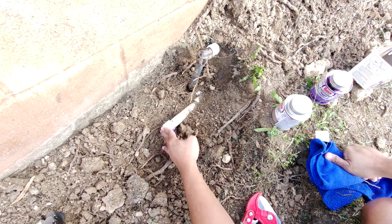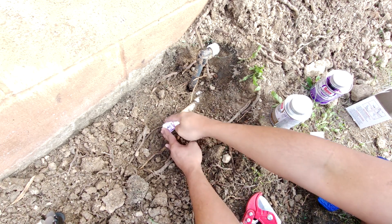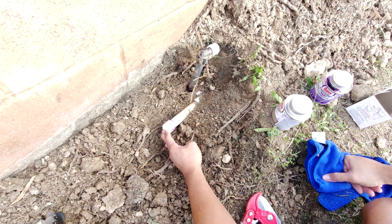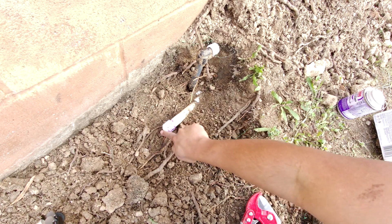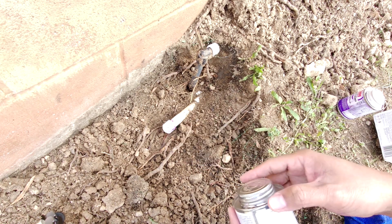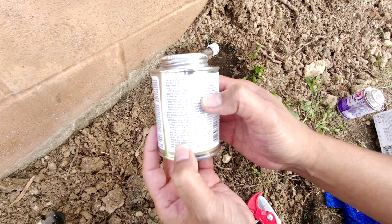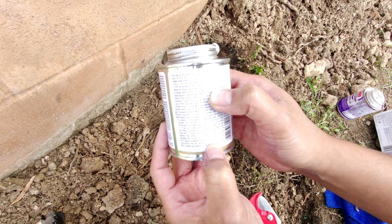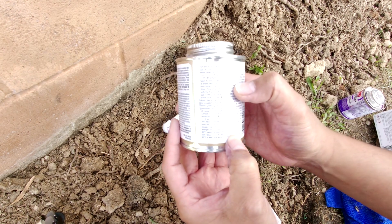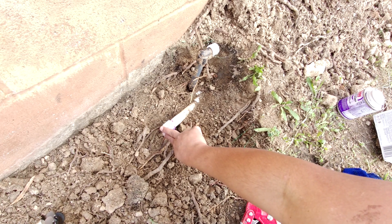You want to push it in for a couple of seconds — count up to 30 seconds — because if you don't, it's going to pop out. 30 seconds should be good enough. Now you can let go. You hold it for 30 seconds and then according to the label you want to wait 15 minutes for good handling strength and 2 hours cure time at a temperature above 60 degrees Fahrenheit before testing it up to 180 psi. If you wait for a longer cure time it will be a lot better. I hope you like this video — please click the like and subscribe button to help my channel.